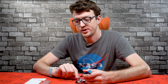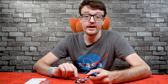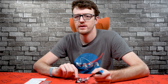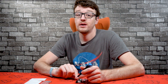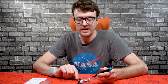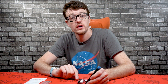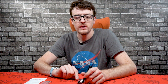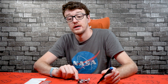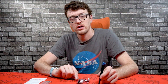If you'd prefer to power it via a more permanent soldered cable — for example if you're embedding it into some kind of fixed art project — you can solder directly to the board for that extra security. It's still plugged into the same power circuitry, so it's still an 8 to 24 volt input. Depending on what voltage you put in, it does change what impedance the speakers can be on the output and also changes the power output. That 30 watt RMS and 55 watt peak assumes a 24 volt input and an 8 ohm set of speakers.